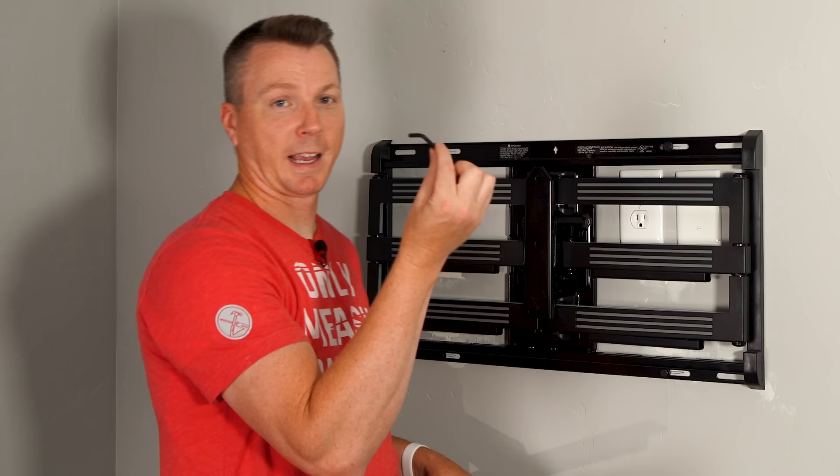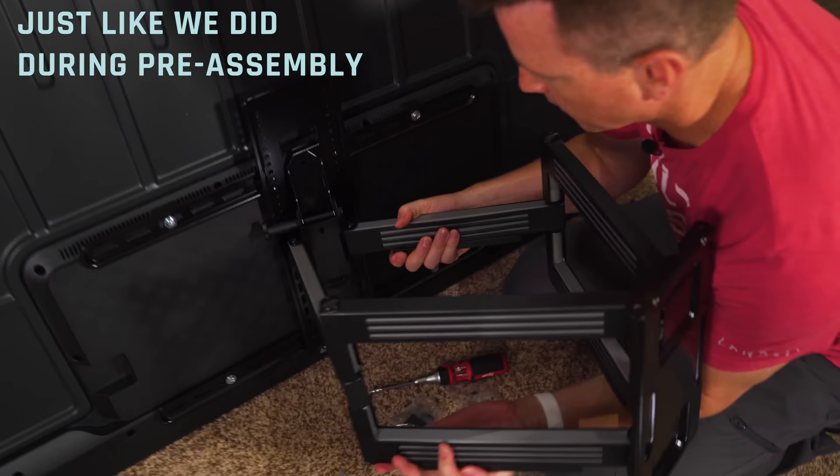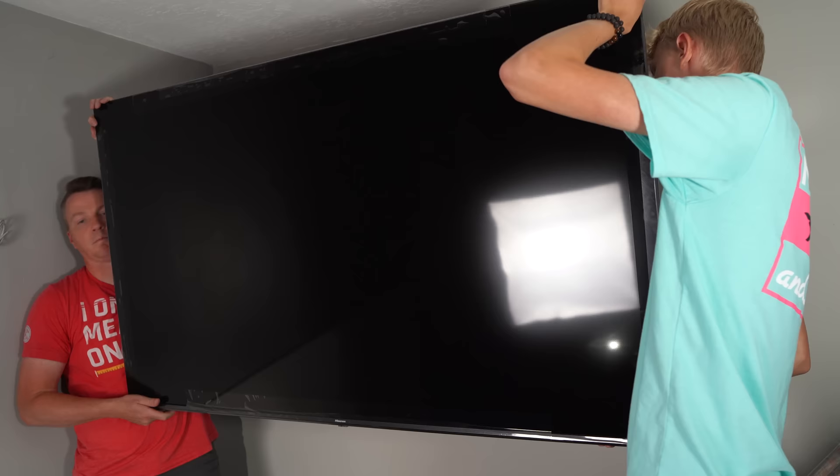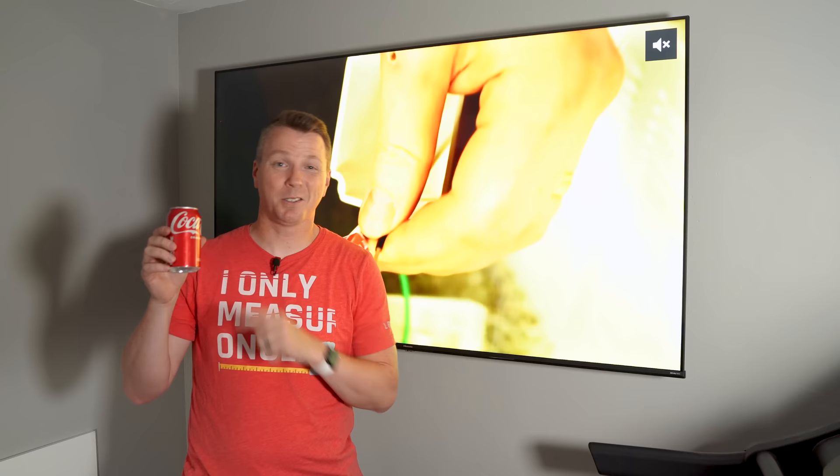Before we mount the TV itself, there's a cool little idea where you can stash the hex key inside the arm, and it's got decorative covers that go over. Now with everything in place, we're just going to drop the tapered end into the hook like this — and this thing is ready to go. We just have one screw left to put in the bottom and it'll be nice and secure. Now that you've completed those five simple steps, there are two bonus steps: first, you deserve a nice cold drink. And second, if you've got wires under your TV, I've got a video to show you how to get rid of those for good in a way that's totally up to code. My name is Nils with Learn to DIY — thanks for watching.